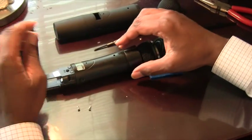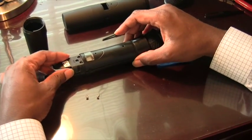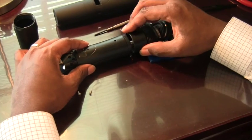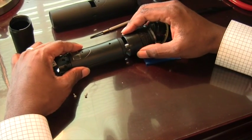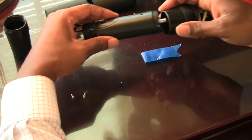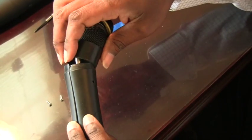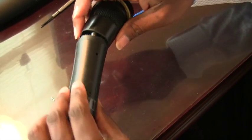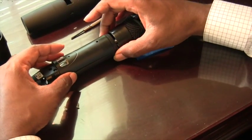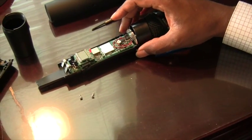Now that you have this all separate, it's two separate pieces — the top comes up and you can feel this ring and slide it forward just a little bit. That's really why you had to do all of this, because if you just tried to open it from the back you can't get it off. That little disc is held together with that bolt, so now that you have it all loose, you can remove the top.